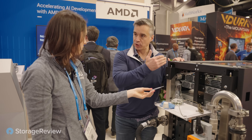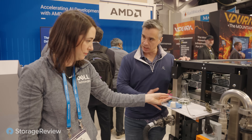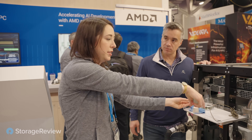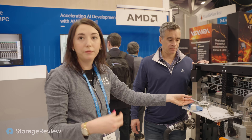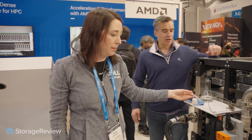This is cabled to your monitor now, it's cabled up. So we'll simulate what this would be around the system or in a drip pan or other places. This valve right here is what's going to close once the IRC recognizes — through the conductivity of the leak rope itself — that a leak has occurred. At the same time, we'll show you the console where the alerting is taking place.